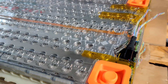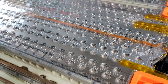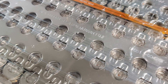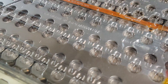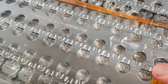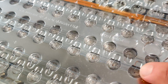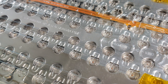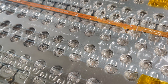One of the issues you might run into if you try to pull too much current out of these modules is blown cell fuses. Each one of these cells, on both the positive and negative terminals, has a small fuse wire. If you see those tiny little metal wires — if too much current is pulled out of any one of these cells, that wire will melt and disconnect that cell from the module and from the pack.